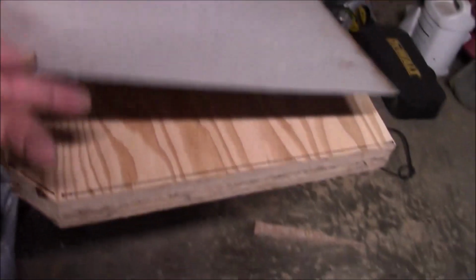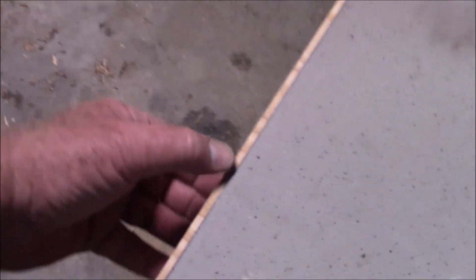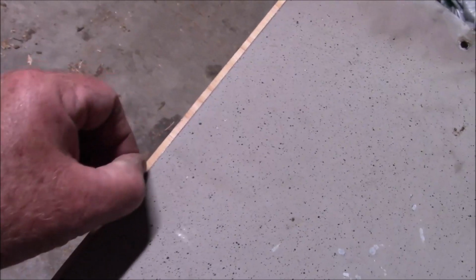Came out really nice. Came out pretty much exactly what I was looking for shape wise. I got some pictures I took with a camera I'll stick up in there. But so there's basically the transom. I made it just a little bit wider because there was about, oh, I don't know, 1/4 inch aside that this aluminum was lacking. So I made these a little bit tighter to the hull.